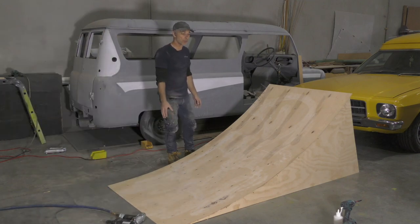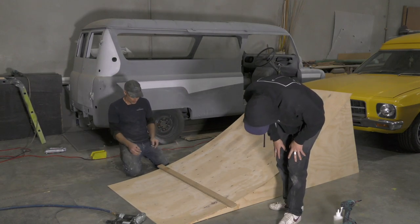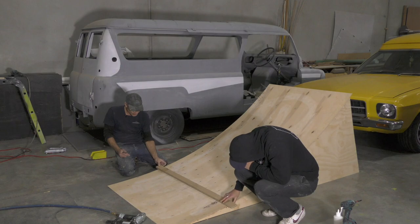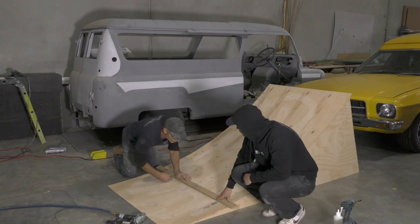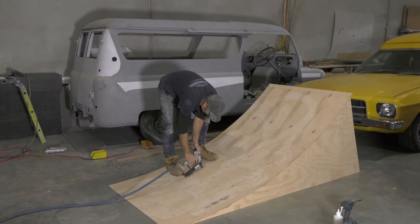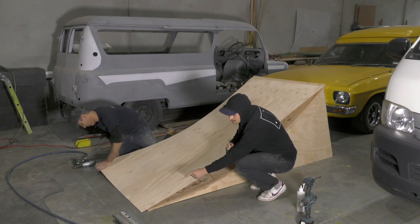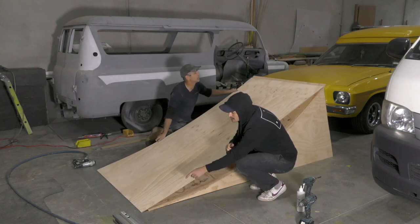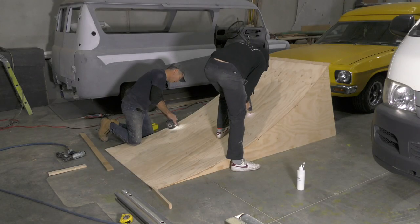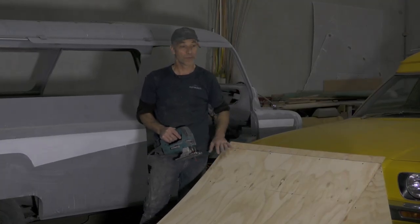Get someone to line it up at the bottom then drop it down onto the liquid nails. Once pinned down square with the bottom and both sides, nail down the middle using the rib marks as guides. The sheet hangs over 20mm past the last rib so it meets the ground nice and flat. Trim the top piece with a jigsaw and hit it with the disc sander.